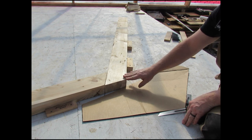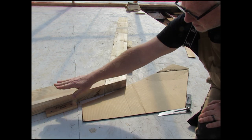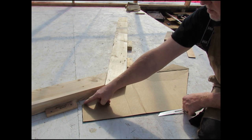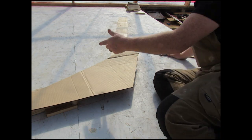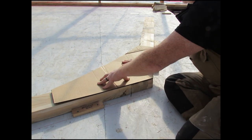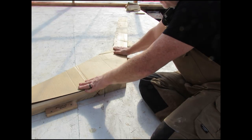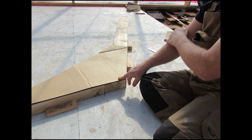And then on a piece of cardboard you just draw on that angle. And for our plans, we know the gusset recommends going up 18 inches up the side frame and 22 inches down the bottom frame. So measure 18, 22. We know the timbers are 5 inches wide, so we put a 5-inch perpendicular and then essentially connect the dots. And the way George Buehler says, it should be a gentle slope as if you could drive a car up. So generally, so far, I found that just connecting those dots is fine. And then the next thing you do is you take this pattern and trace out the gussets on the plywood to cut.